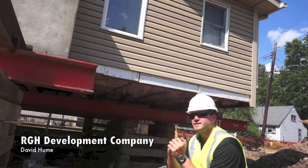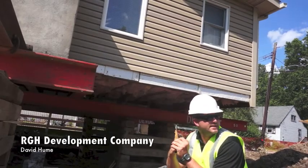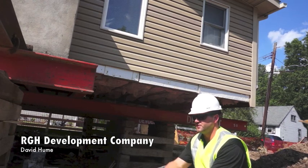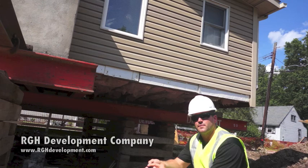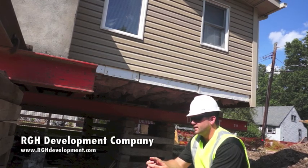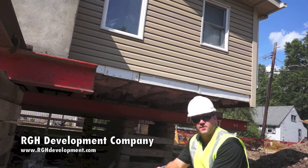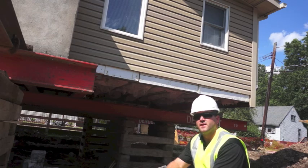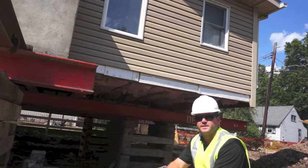Hi, my name is Dave and today we're going to be talking about house lifting. One of the biggest things you have to do prior to actually lifting your house is doing your utility shutoffs — capping your water and sewer lines, making sure your gas is turned off. You don't want live gas in the ground while you're excavating. Those are major items you have to do and can be time consuming.